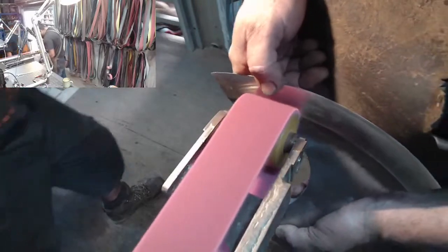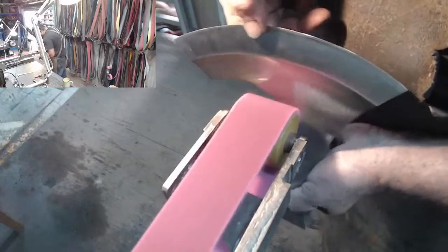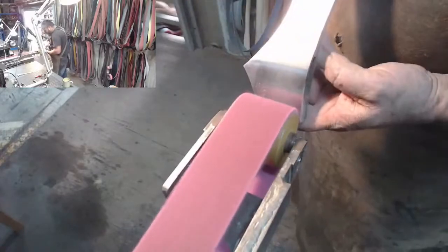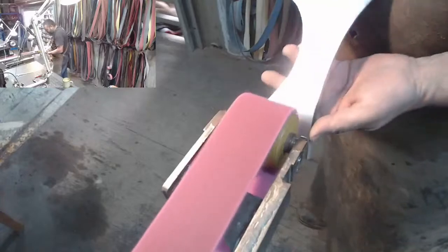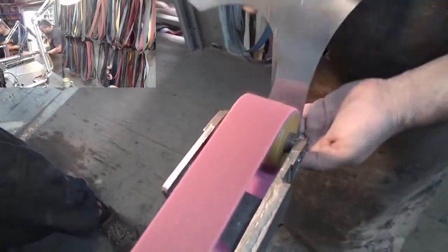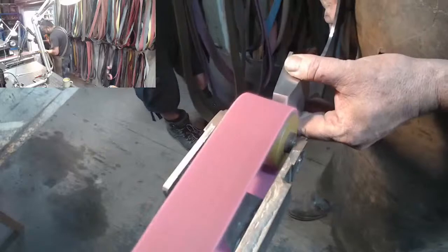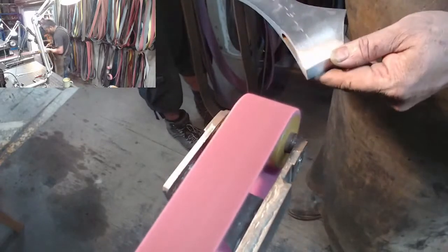Give me a new gray as well. We're going to go over to the larger wheel, which gives me a better finish, because on the small wheel you get a shuddering. So as soon as I'm done on this one, would you mind just flipping me over? And like I said, this is a preliminary finish. It's not the final finish that we'll have on this axe.